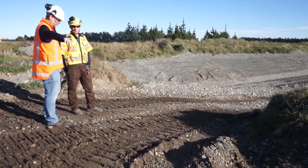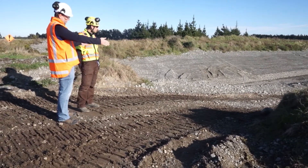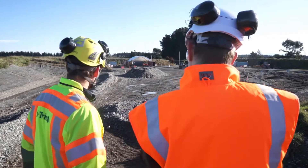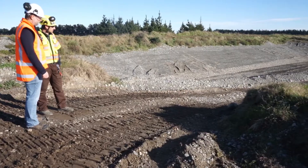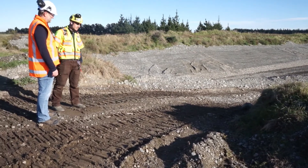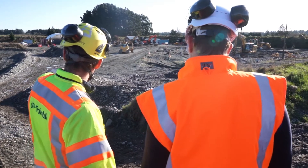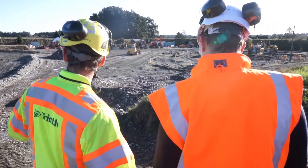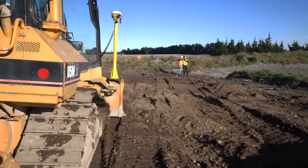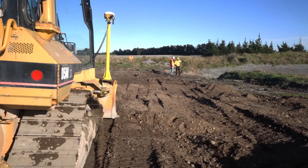We've got some 30-ton trucks coming up here, so we need to basically make a wider and longer ramp to suit the trucks that are going to be coming up here. 4 metres either side will be good. In terms of length, if I finish the ramp where it finishes now but start it a bit further back so we can get a not-so-steep grade on it - maybe I'll start it a couple of lengths back behind the dozer there.